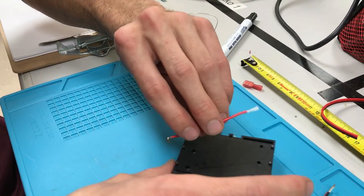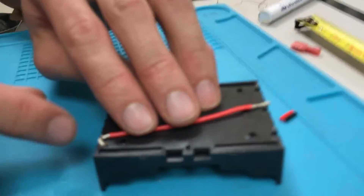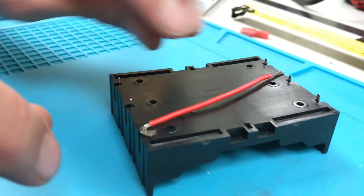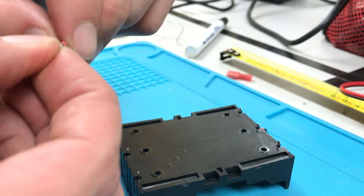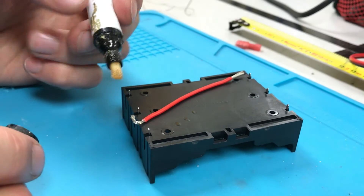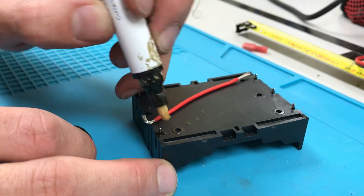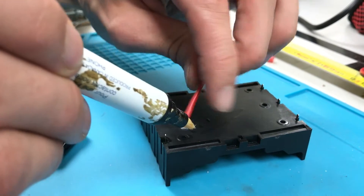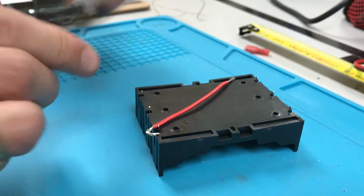When you put this on, we need to stack up the odds in our favor because this wire doesn't like to solder very well to the steel pins — the heat can kind of escape in too many directions and it doesn't like to stick very well. So make that gentle U-shape and then go ahead and apply some rosin. Use a rosin flux pen, making as much contact as you can on your wire and on the pin, and that helps your chances of the solder flowing where you want it to go.